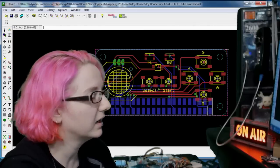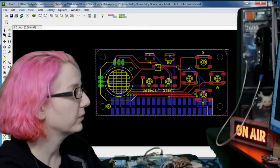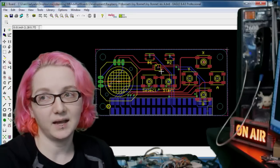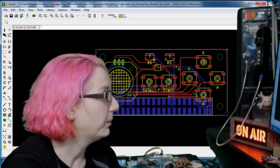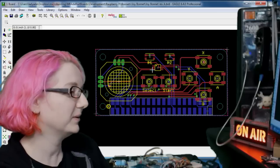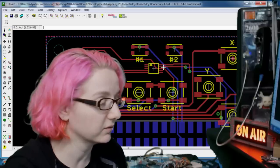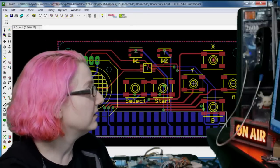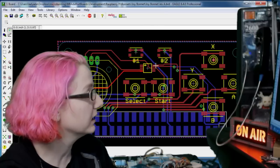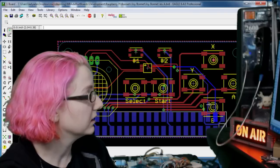And then here is an analog joystick. Like I said, this is used in a PSP, and it has a potentiometer for each axis. This is a 3-pin potentiometer for X, and then a 3-pin potentiometer for Y. Since the Raspberry Pi doesn't have an analog-to-digital converter, we popped one on. I could have used an ATmega or something, but it was pretty easy to just use an ADS1015. It's an all-in-one analog-to-digital converter over I2C. It just reads these analog voltages, you can see the center pin here and the center pin here, and then sends them off to the I2C bus over here. Very easy.